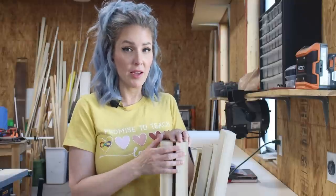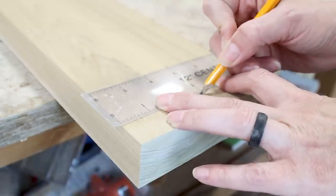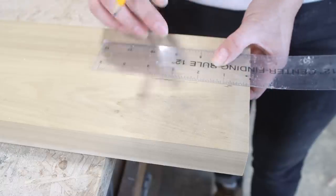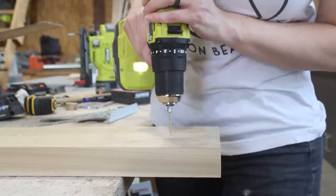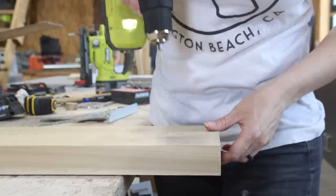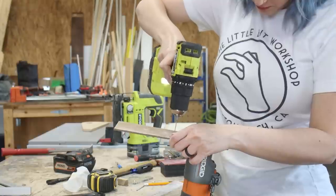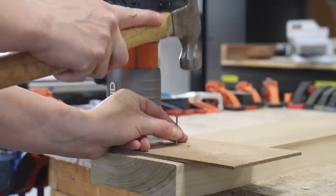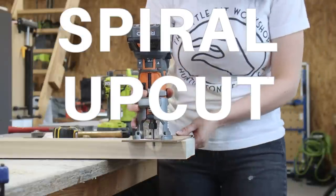Each board is going to be arched and also receive a bullnose edge — a double round-over edge — which means I need to pull out my router, and it also means lots and lots of sawdust. The first thing I did on each board was to find the center width-wise. I then took that measurement and measured down from the top edge, which gave me the center of the radius for each arch. I marked the radius on a little DIY circle jig, which is basically just a board with a hole cut out screwed to the bottom of the router. I attached the circle jig using a finish nail and began to slowly cut each arch using a quarter-inch spiral upcut bit.